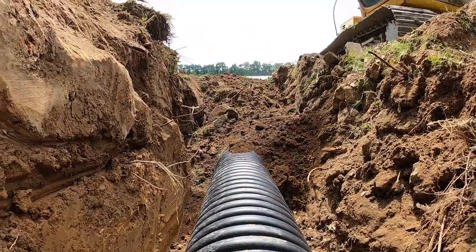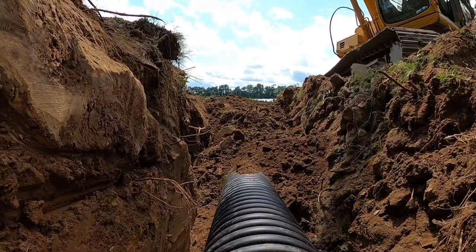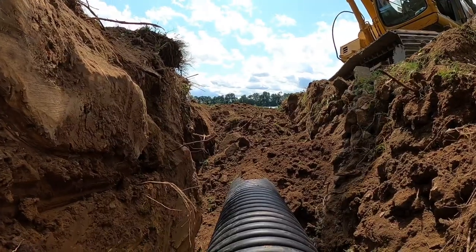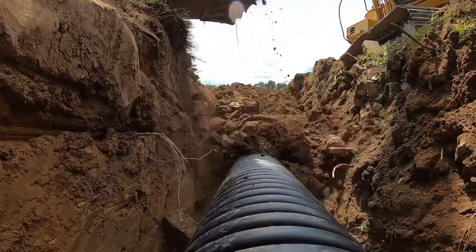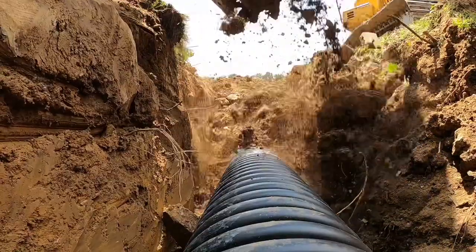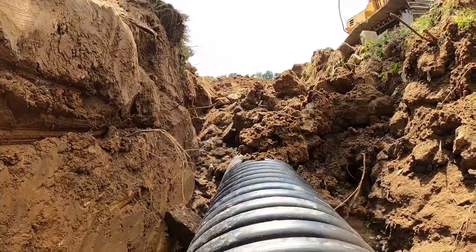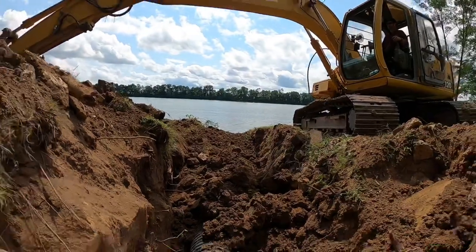All right, guys, before I get 1,000 comments, I'll go ahead and address it. The squeaking you hear in the boom from time to time is not actually a pin on bushing squeaking. It's actually the shims on the main boom pin. Hindsight being 20/20, maybe we should have worked a little bit of grease up between them and prevented that. But nevertheless, over time, it should take care of itself. It'll get some grease up in there. You can actually make it quit with a little bit of penetrating oil. So hopefully that makes sense, and that explains the noise you're hearing from time to time.